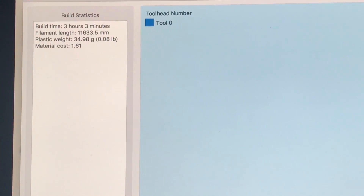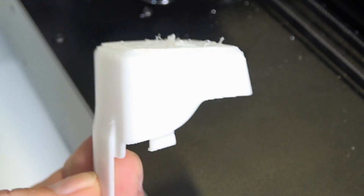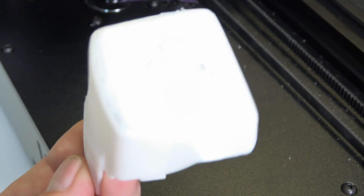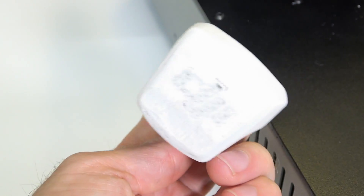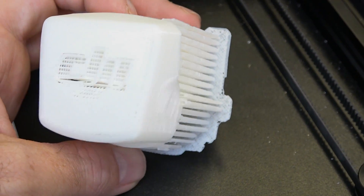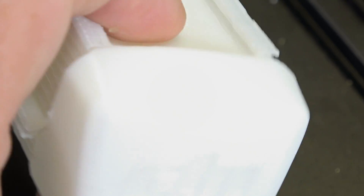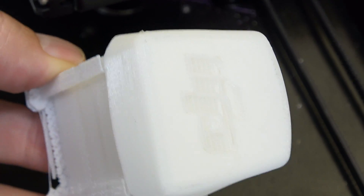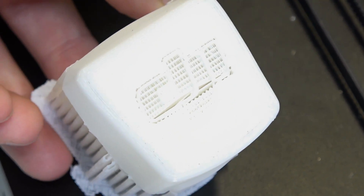Now while we're printing drone parts, let's print some more. We have a DJI Spark gimbal cover — I did a raft on it with no supports as instructed, and it didn't fare well. On my second attempt I still didn't learn my lesson. So I ditched the raft idea and flipped it upside down in Simplify3D. This is a little better, but still not perfect — there are some gaps between the DJI letters and the edge of the gimbal cover. I may need to try 100% infill. With 3D printing, it's always about experimenting, so don't get upset if you don't get it right the first time.